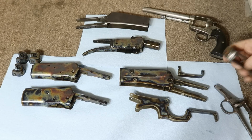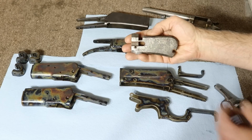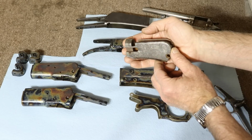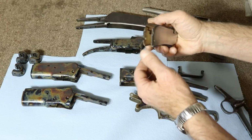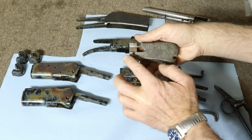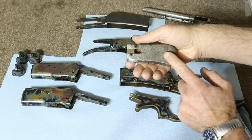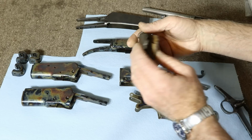Now, here's an example of an 1906 or 1890 receiver. We can see one side is just horribly pockmarked and pitted, and the other side we've polished up. And literally, just on that easy flat side, it took several hours of draw filing to get to the bottom of all those pits, because you have to get to the bottom of the deepest pit if you're not pit filling with something like a laser welder, and then go through the different grits.